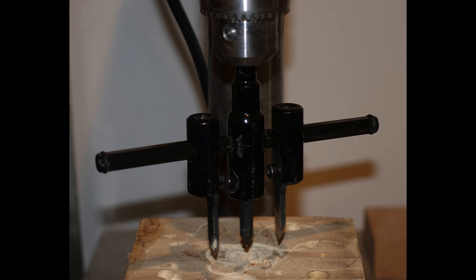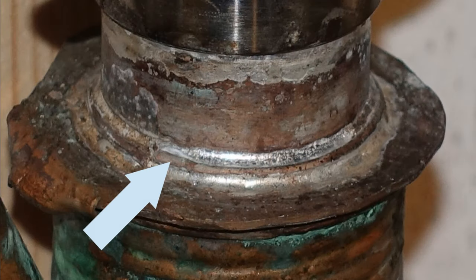At 28 or 35mm or more it can be quite hard to achieve a hole that is that precise. The solution here is a wire ring like this. You form a piece of solid copper wire into a ring that tightly fits around the pipe to be soldered, then after a bit of squeezing and manipulation and trimming to length you arrange it so it fits snugly in the corner between the pipe and the sheet. That gives much more area for solder to flow into, making the joint stronger and more tolerant of imperfect gaps.